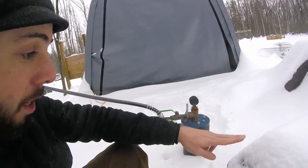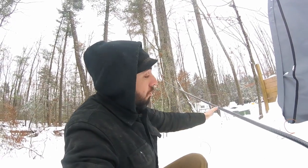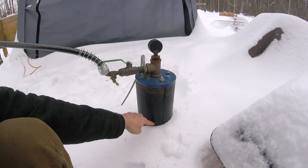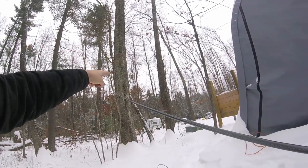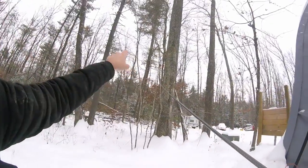When I pump water up the hose and then down the hose to the camper and turn it off, from the high point up there the water drains down towards the camper and also back down to the casing. The way it drains back is at five feet down inside the casing there's a little hole drilled in the side of the PVC pipe. Water pressure gradually pushes down and trickles out until all the water is out of the pipe up to the high point of the hose.